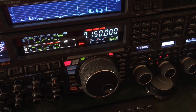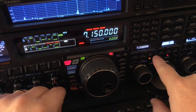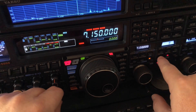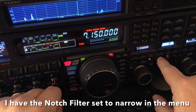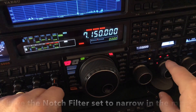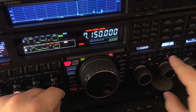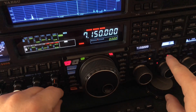So that's an either-or. You can use the notch filter if you really do want to listen 2.8K wide. Or I can turn off the notch filter — there's no harm in running it. Your ear would barely detect that, and I'd say even most people's ear wouldn't even detect it. Some may — if you're using the amber, it'd be a real bright amber. So I could turn the notch off, and the noise is sneaking back in.